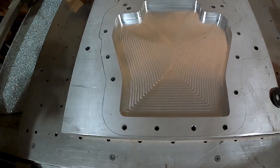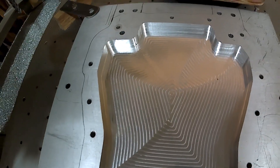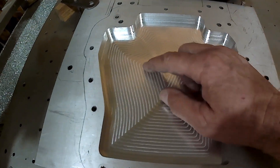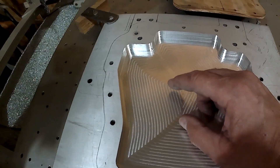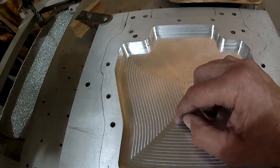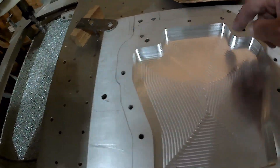I figure that's only an 8 millimeter end mill, three flute aluminum end mill, carbide. It's cutting a depth of about 35 to 37 thousandths per step. I'm cutting it 80 inches a minute and it does a 50 percent overlap, so you're only cutting about 2 millimeters, or 4 millimeters, because it's an 8 millimeter end mill. Each pass is taking off roughly just under 40 thousandths. So it takes many, many passes.